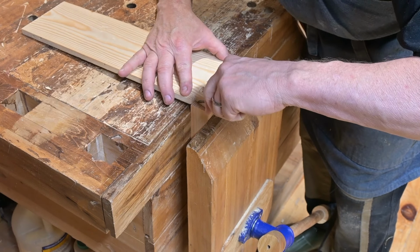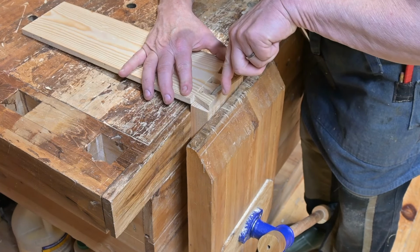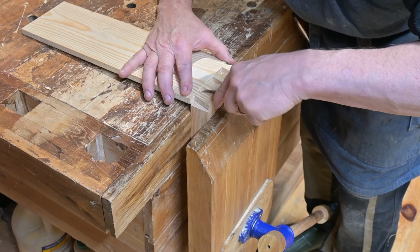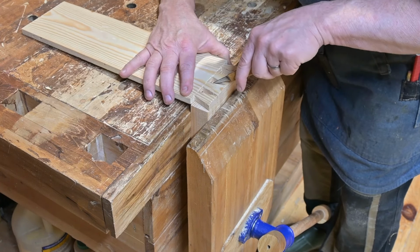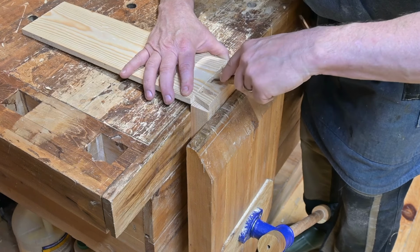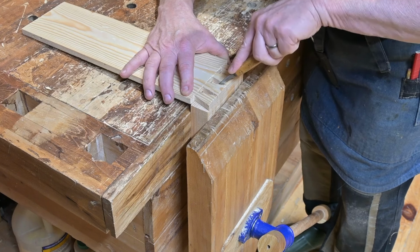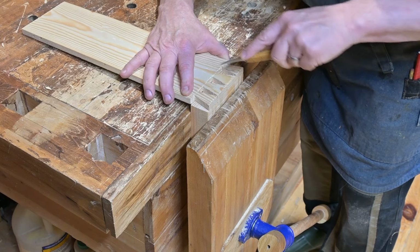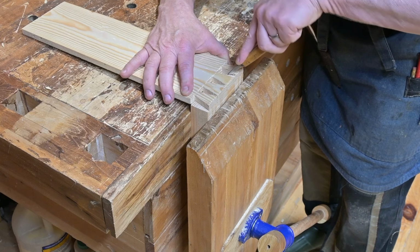Use the resulting dovetail, or simply tails, on the thinner board as a pattern to mark the thicker board. Scribe with a marking knife. On this board, remember it is the matching tails that will be cut and removed while the pins will remain, and thus you have your dovetail joint. Be sure that you have lined up your board edges accurately.